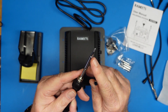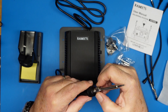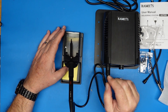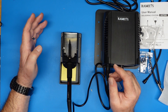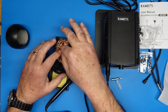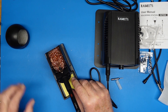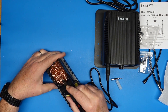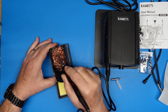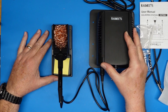There's a little shoulder on the heating element that the collar slides over, with an indent that holds the shoulder down to keep the metal iron in good contact. When you're using this, the iron goes in the holder where it's not touching anything. You can shove your soldering iron in there — I like that, that's not a bad idea. So instead of using a separate cleaning gadget, there's your cleaning material right there. Every time you jam your soldering iron in there, you can stick it in and rotate it, or come up here and do it that way. It's one less thing on the bench in the way when you're trying to solder.